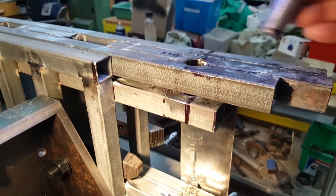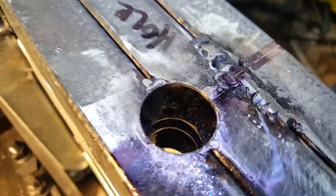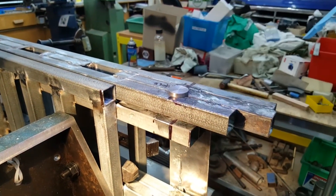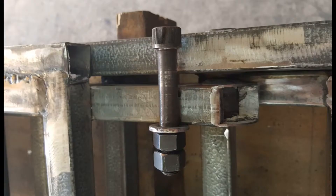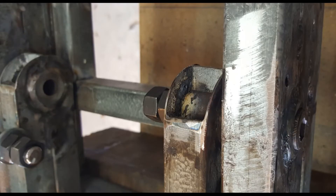I had to make the second ramp and included some modifications in the build. This is just another bit of video showing the hole that was bored in the milling machine for the hinge pin — that's a temporary alignment pin just plugged in there. These are the bushes I turned up for the hinge pin and the cap head bolt. It's a half-inch bolt that has a whole lot of bare shank on it so that there's no thread in the bearing area.